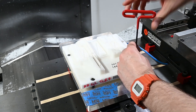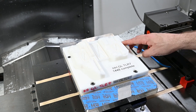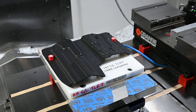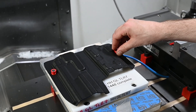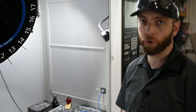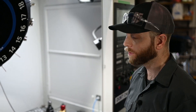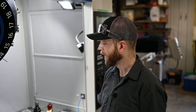This gets bolted down, then we lay a shell directly on top, turn on the vacuum, and the vacuum holds the shell down. We've also got two rare earth magnets set into the fixture for security. You can use magnets to completely hold a shell with enough magnets in enough key places. I prefer vacuum because it dampens vibration and reduces edge chatter when trimming, but we use magnets for security — it lets us put down a shell with no through-holes without needing screws. Previously we did a two-step process pre-drilling holes at the drill press and using screws, which works but is slower every cycle.